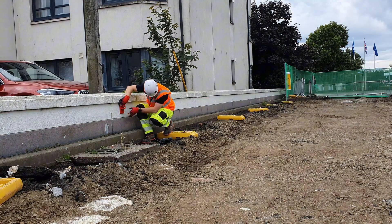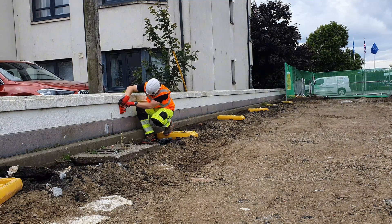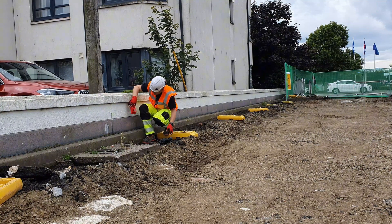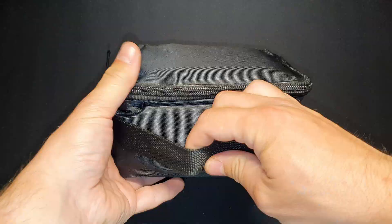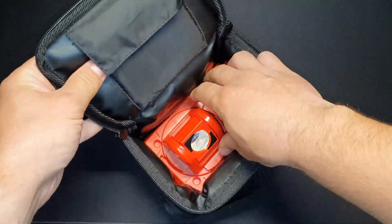Because I am a suspicious surveyor, I tested it myself on one of my sites. I marked a few grid lines at a three meter distance using the RS150M, taped them, and the difference was around two millimeters. It arrived in a couple of days and came in a very practical small carrier bag with a strap that is padded and protects the prism very well.